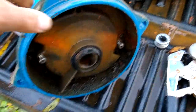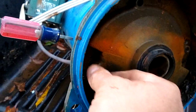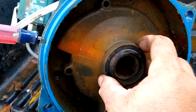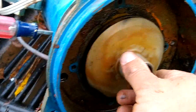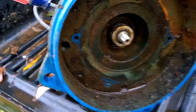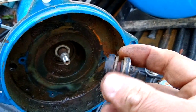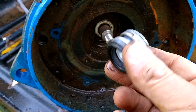Then you need to take your bolts off here. I already got everything loose and I can show you quick how it comes off. There's the cover to the impeller. This is held on here — it's threaded. I got a screwdriver locked in there to keep the motor from spinning, and then this basically just unthreads off of here. There's a spring-loaded seal inside here. Here's the new one. Gonna clean that up good first before we put it back in.